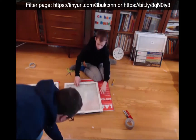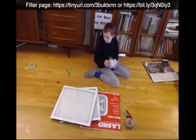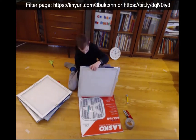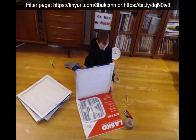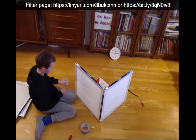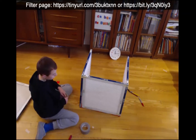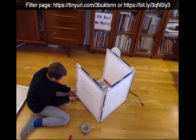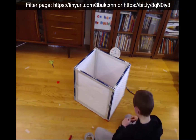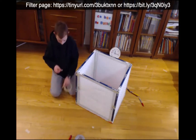When you dispose of the filters, it's a good idea to wear gloves and a mask — we should have done that. We're taking out the old filters and putting in the 2200s, which have better ratings and will catch more stuff as they filter the air. Make sure to follow the arrows — they should all point inwards on the box. There's an arrow on each filter; it points in the direction of airflow. We're using masking tape to temporarily hold each filter together, and once done, verify again that all arrows are pointing inwards.